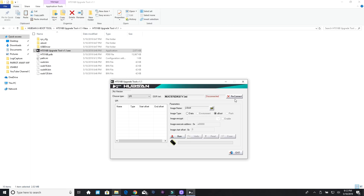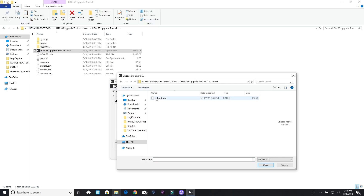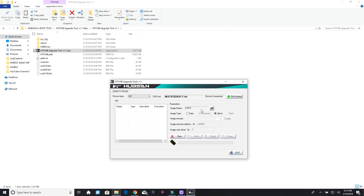Go up to the upper right-hand corner and click Reconnect. You want to see that turn green — green means go. On the Reconnect we have a green light. You'll see it says 'u-boot' in the image name, but that doesn't mean you've successfully loaded the file you need — you still have to go get the file yourself. Click the folder, go to the u-boot folder, and double click the u-boot.bin file.